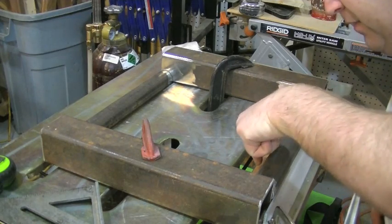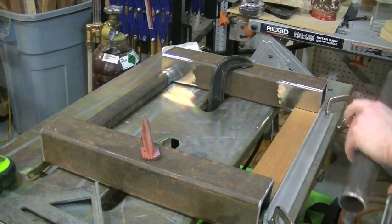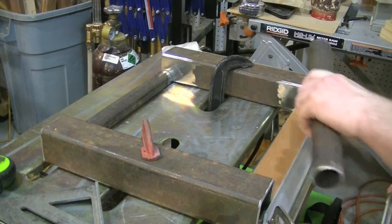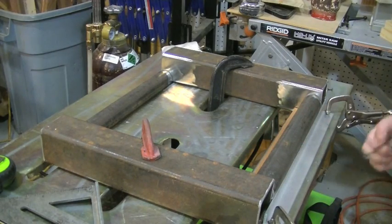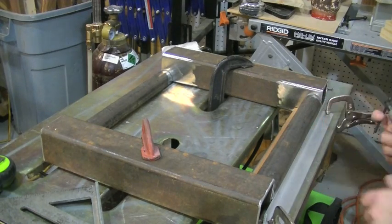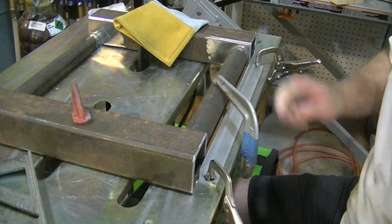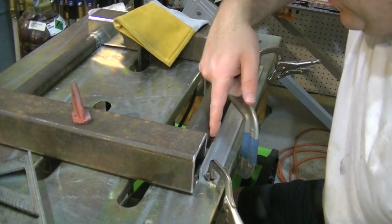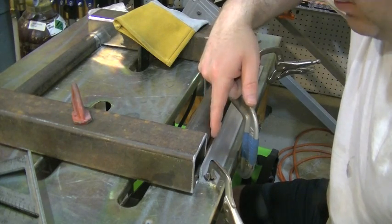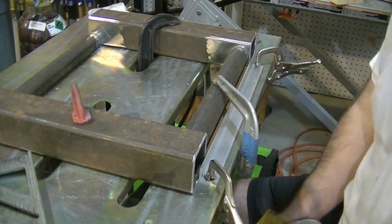What you can't quite see in the video — there's a half-inch piece of wood that's kind of supporting this to sort of center it up in the center of the square tubing. So let me get this clamp down, and we'll fire up the welder and lay a few tack welds in there, flip it over, tack weld the other side, and then we'll be ready to lay some beads. One little thing I should note — when I clamp this down, I rolled this piece of tubing in towards the center just a little bit, so I got about an eighth of an inch between the side of the round tube and the edge of the square tube. Just a little bit of a lip there, both sides clamped down in place. Put a couple of tack welds on there.